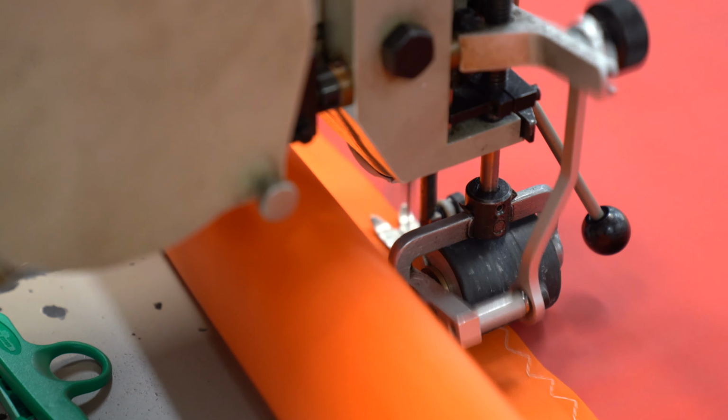To be able to depower or completely roll up your sail and put it away via this furler, it's gonna make sailing your kayak much less intimidating, and I would guarantee you're gonna be using the sail a lot more often once you have this accessory. So to start, I'm gonna mount this on the mast. You'll probably have to take this Allen wrench and loosen these Allen screws from the nuts on the back.